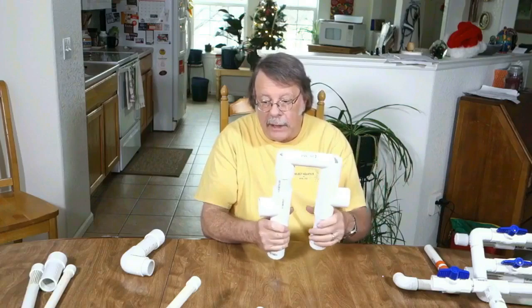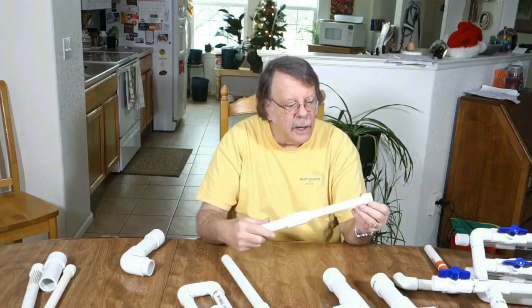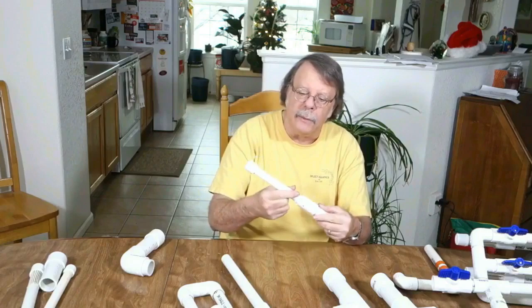So when I first started putting these siphons together, I used this type of strainer, where I just drilled a bunch of 16th inch holes into the bottom of a half inch piece of tubing. These worked great for a long while. If the holes were throughout the whole piece, then it worked good.